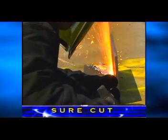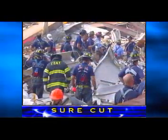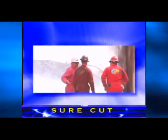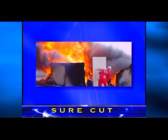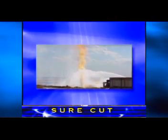For gouging, the oxygen pressure can be varied to give the operator more precise control. The SureCut system is ideal for companies performing maintenance on heavy equipment and is also used by fire and rescue personnel for breaching operations and rescue work. Companies like Boots and Coots use this system when putting out oil well fires. The system can cut underwater, affording the capability of keeping personnel under a heavy spray of water and still being able to cut into oil field conductors or cut heavy bolts off well head flanges.